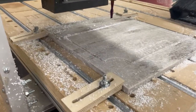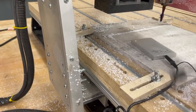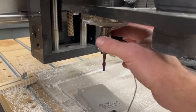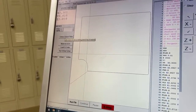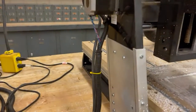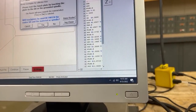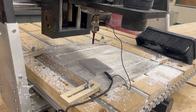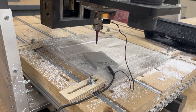How we do that is we grab our Z zero plate right there, and we also connect our magnet onto the collet nut to make sure we can create a circuit. We select the touch plate on the software, double-check that we have conductivity by touching the bit, and check on the computer screen that we get that green success — touch circuit complete. We put the plate back down and press yes on the computer so that it comes down to check our zero.